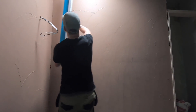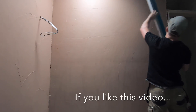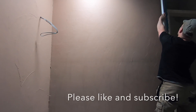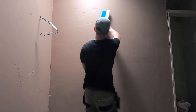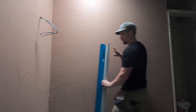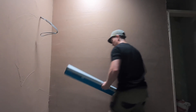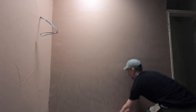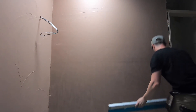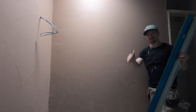What I highly recommend, especially if you're doing one coat plastering, is to use a spatula. I've got the Ox Speed Skim here — I'm not endorsed by anyone but I love these products. If we are doing one coat we need to make sure this first coat is dead flat because this is the only chance we're going to get. Spatulas seem to be the best way to flatten your wall. I've applied the plaster and waited about 10 minutes, but with this speed skim you can go straight over it. Just be aware the plastic blade forces the plaster to set a bit faster.